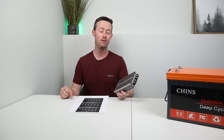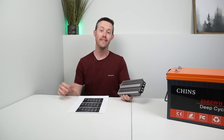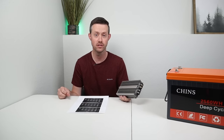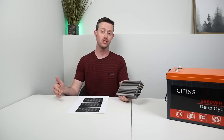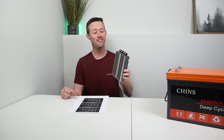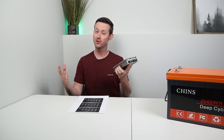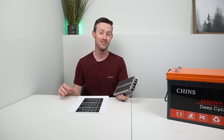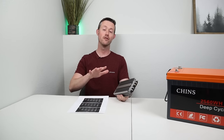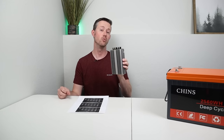Wow, just a little bit more voltage and you get so much more power. That higher voltage allowed all the power stations to max out their charging inputs at least at the amperage and voltage levels. The Anker took in 20 amps — we saw 700 watts from this thing. That's a lot of power; I'm not sure all alternators could handle that, so keep that in mind. But we saw really good numbers on all the others too, from 530 all the way down to 430. So this one did perform really well.